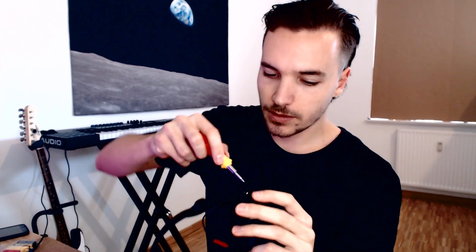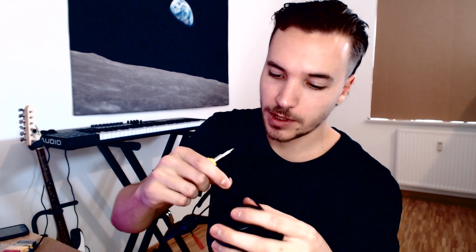Now, this cable, I've got to get some pieces of this wire from the ends to separate to the headphones. I'll solder the two pieces onto here and these connectors. Just for those who don't know, to disassemble these headphones, you can basically just pull these out of the top of the cups. They can be kind of tough. So if you pull both of them out, then you've got this little clamp box thing. So you just got to undo the two screws on it, and that comes off, and then the cable's free.